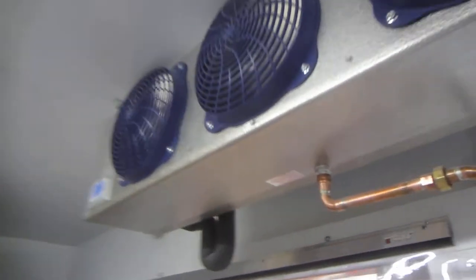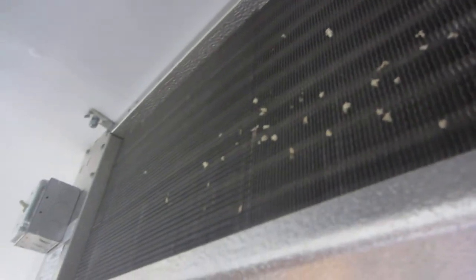The technicians are supposed to do this during their preventative maintenance. One of the things you want to look at is the debris back here — you see a little bit of debris back here, get that cleaned off, it's part of the job. If that's blocked up with debris or dirt or grime, it will suck it in. That is taking money out of your back pocket, making the equipment work a lot harder to maintain temperatures in here.